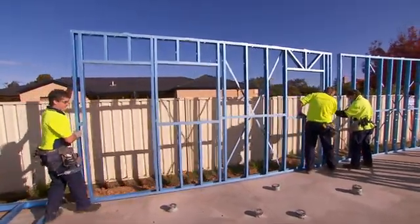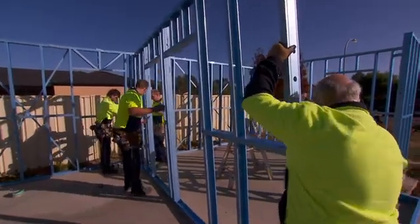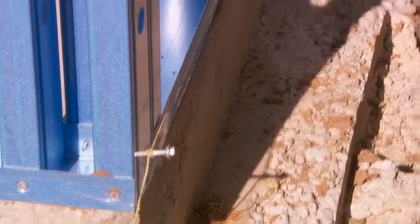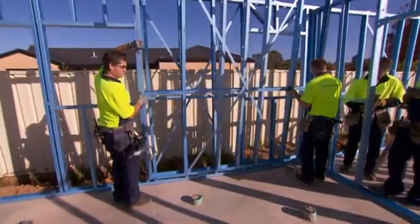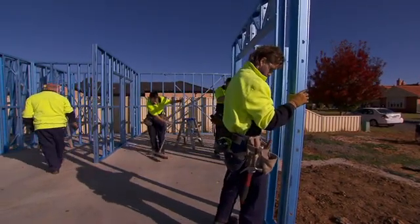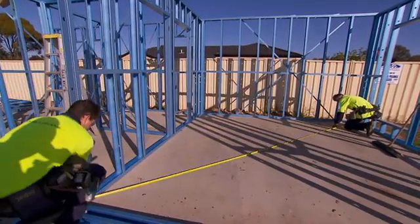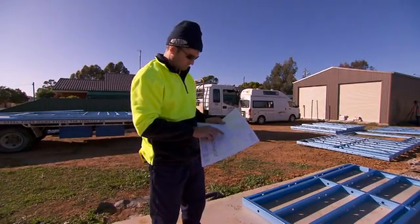Continue standing walls and attaching them together, working outward from the corner. Make sure you set the interior walls inside the building before completing the exterior walls. Run a string line between the two corners and align the wall to the string line. When all walls are standing, complete the frame-to-frame connections in accordance with the details in the construction manual. Move the frames to align with the marked wall position, check room sizes and ensure rooms are square. It helps that the branding is always on the outside, which is the same way the arrows point on the drawing.